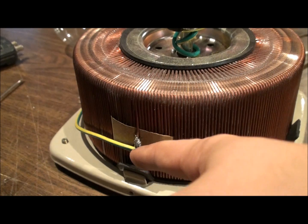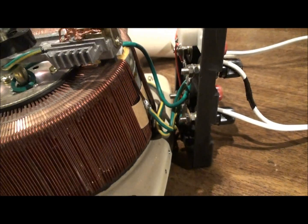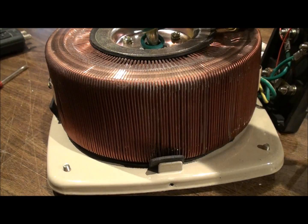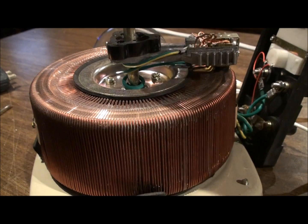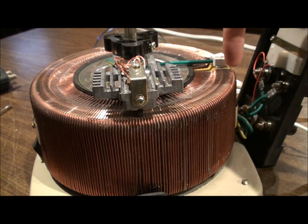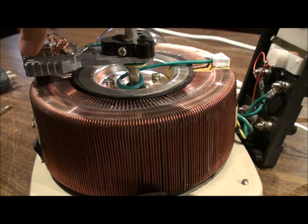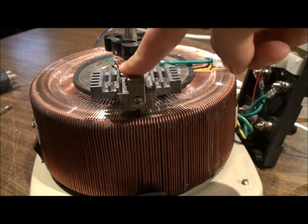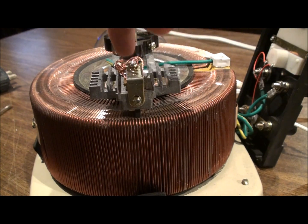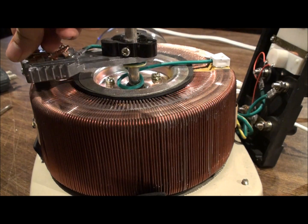As you can see, I have the hot side connected right there, and around on the other side I have the neutral connected to that first winding. This allows me to have zero at one end and 100% at the other, and then I can select anywhere in between. Basically, my primary winding is here to here, and my secondary winding — I select how long it is, how many windings that is. If it's a 1 to 1 ratio I get a 1 to 1 output; if it's a 1 to 0.5 ratio I would get half the voltage, quarter of the voltage, and so on. And because it slides across, I'm able to get a smooth and continuous non-stop update in voltage.